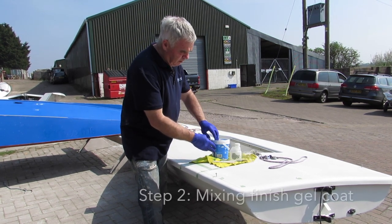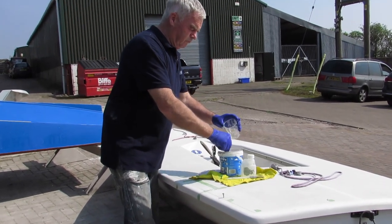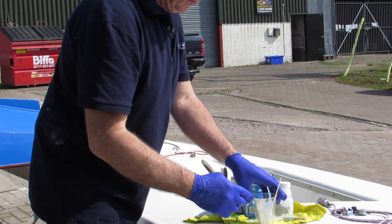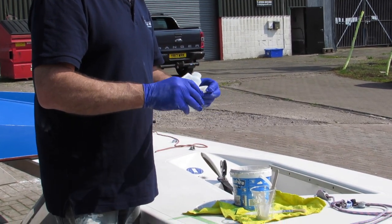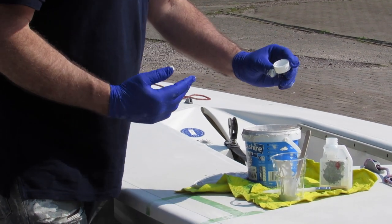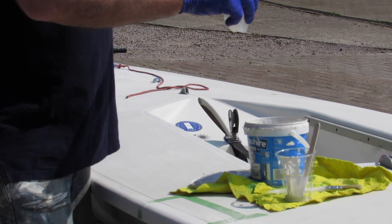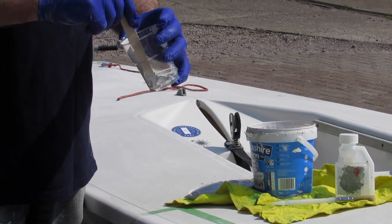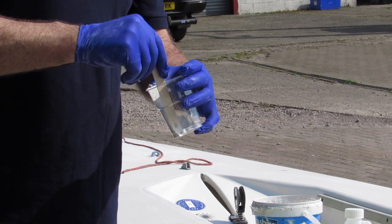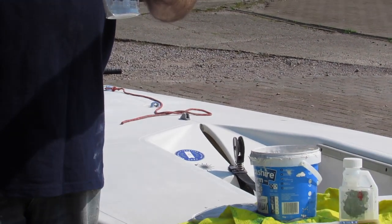And this time, it's just going to be the gel on its own — no filler powder added in at all. So we're just going to dish some out into a cup, push it down into the bottom as much as possible. This is very fluid. And again, we're just going to add in some catalyst — just to remove the inhibitor that's stopping it going off in air. Just pour some into the cup; it makes it easier to dispense. Literally that was only about five or six drops and that's all you need. Just mix that in, make sure it gets right into the gel. Just spend about 10 to 15 seconds doing it, push the gel down off the side so when you put your brush in you're not going to pick any off from the sides. As we can see, that's very runny — no filler powder in it at all this time.